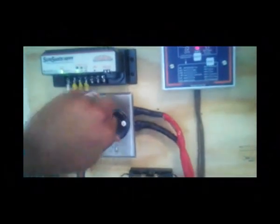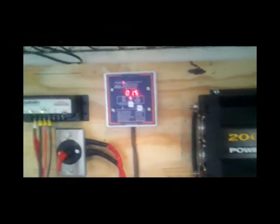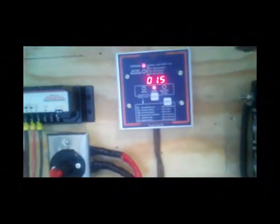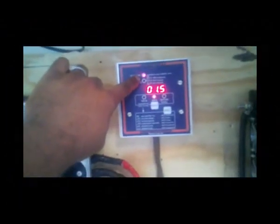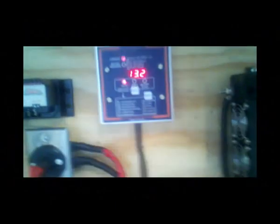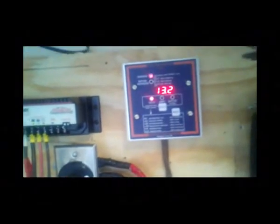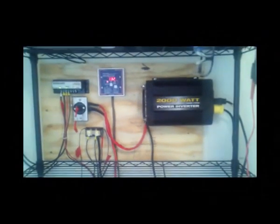With this kill switch, I can simply turn everything off. I get the alarm from my inverter saying it's just lost power, and it shuts off — that kills everything. As you see here, the negative sign went away and now I'm putting 1.5 amps back into the system. This light just means I'm charging. It's a little after 5 p.m. and I still have daylight — still charging. There's 13.2 volts coming into the system. That essentially is my solar backup system in a nutshell — very simplistic but very effective.